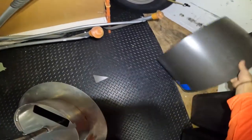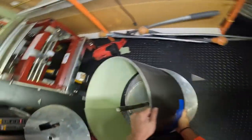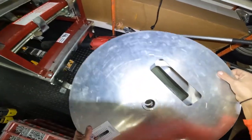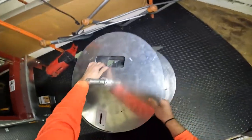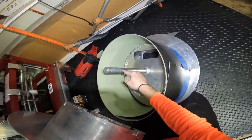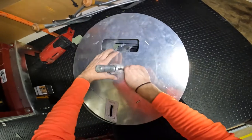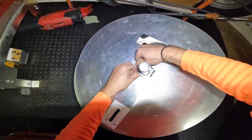This is a very small coil, just a little extra coil for demonstration. The typical coil would not be this loose — it would actually be a lot tighter — but since this is a half-run coil, that's why it's sitting so loose on the spool. On these spools you have two different settings, two different areas where you can put the pin. This one's for five-inch gutter and this one's for six-inch gutter, so you want to make sure you're using the right pinhole.